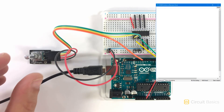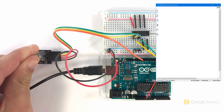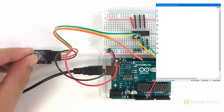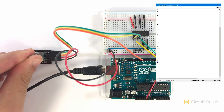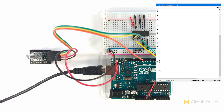Using the same sketch, all debouncing is now handled by the Schmitt trigger. After uploading, the count increases and decreases exactly once for each click of the encoder — it works pretty well. But the whole reason for having a rotary encoder is to use it to control other things, and you'll likely have a lot of other code running in your sketch.